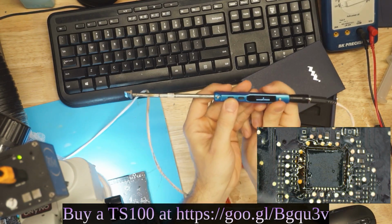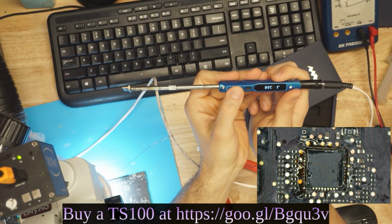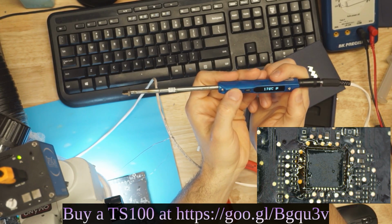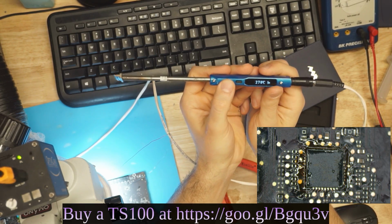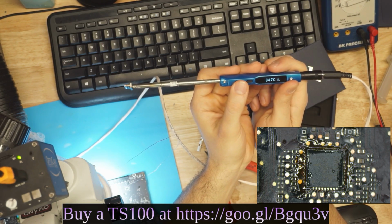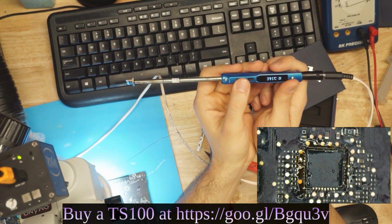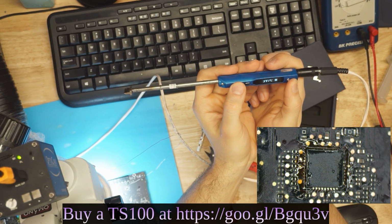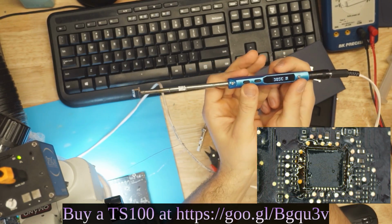Okay, I would be surprised if it's able to heat this one up. Whoa. It's doing it. Holy. 167? 190? It's taking 2.7 amps. Yeah, that was what it was taking with the other one. So it's going to take a while, because it usually takes the Hakko a while to heat this one up. Whoa. It's doing it. It's trying to hold a straight 400 Celsius.